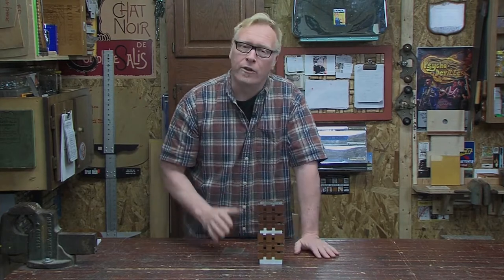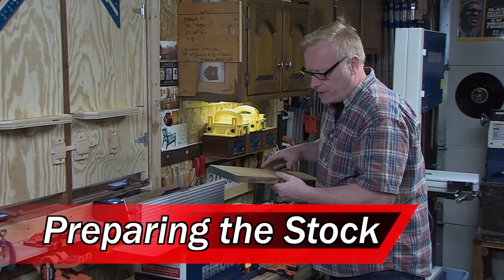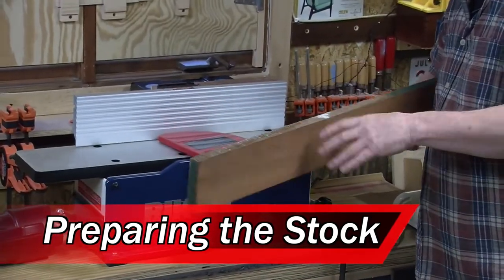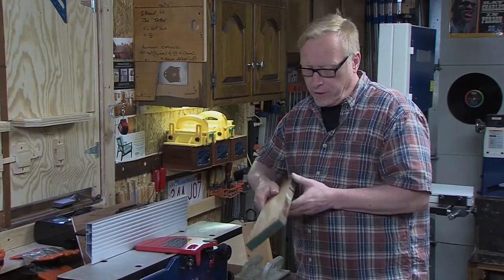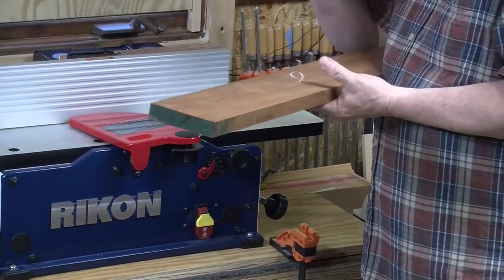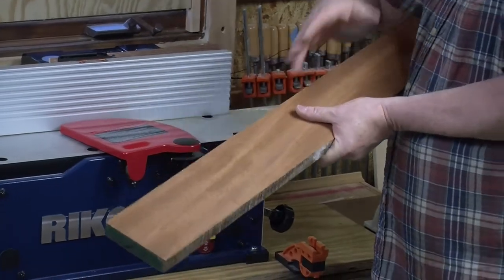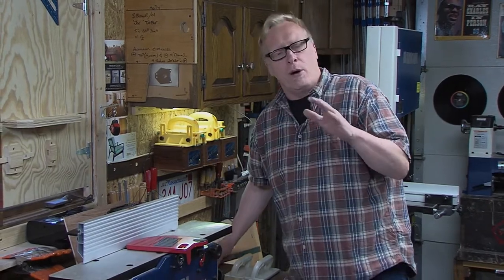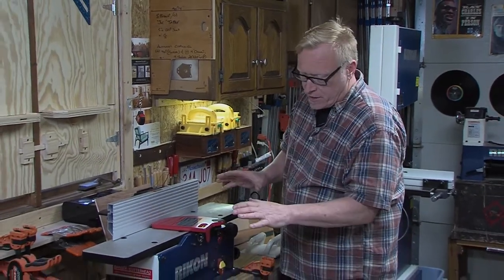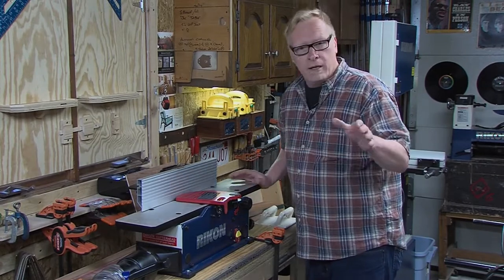The first thing we need to do is dress up our mahogany stock. Our tea lights are made out of mahogany so we're going to use the same stock for our project today. This has been sitting around the shop — it's already been dressed and milled, but it's still susceptible to the elements in the shop and it can warp a little. So we still need to clean up a face, which is the first part of dressing up your lumber, and then we'll take it to the planer and thickness it down. We also need to clean up an edge so we can use that edge as reference against the table saw fence and cut a parallel strip.